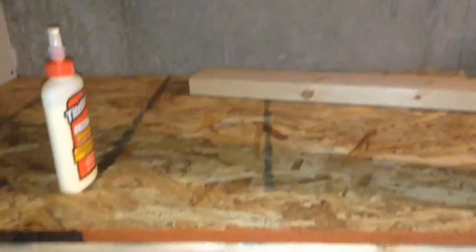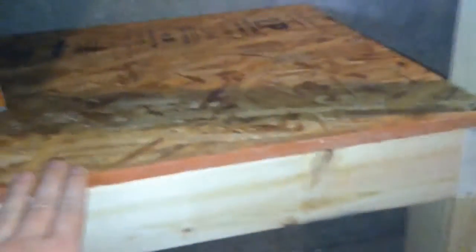So, we've done our frame, 2 feet deep by about 36 and a half inches wide. I'm using king studs, and I'm lining it with a 1x4. As you can see, I'm going to save some room by putting in my shelves first, putting on the king stud. That way I don't have to cut out little rabbets. And this thing should be able to survive an earthquake.